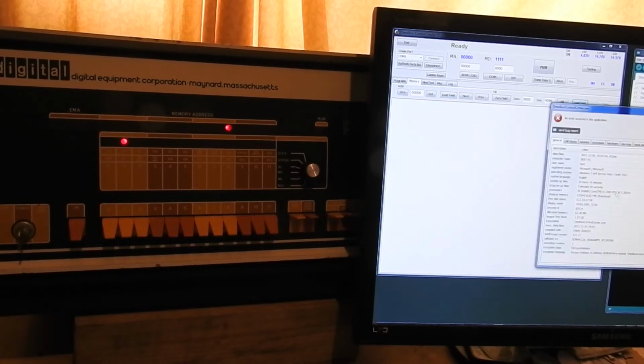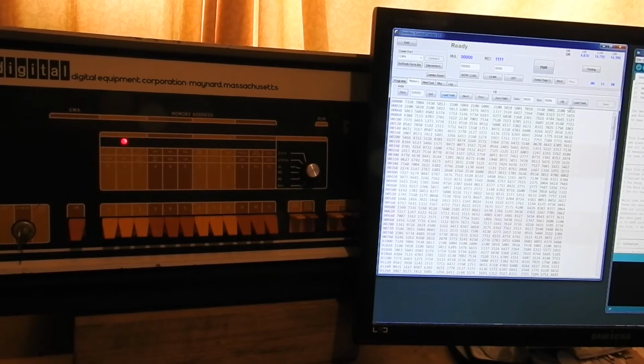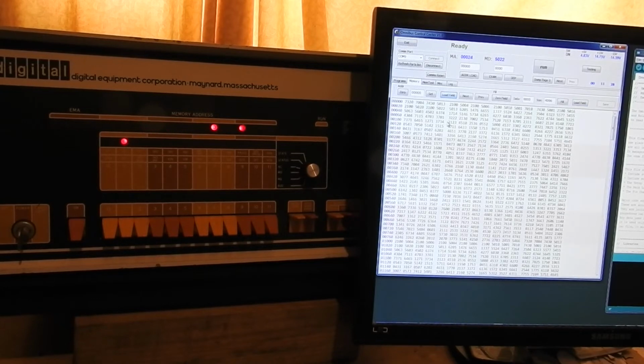There you go. There it is. Sometimes it works, sometimes it don't. I haven't got to the bottom of it yet. But if it did work, it would be faster. The communications is pretty basic. It doesn't even do any timeouts, any flow control, any sequence checking and retries.